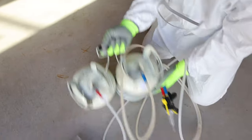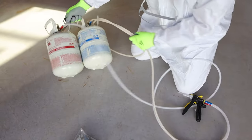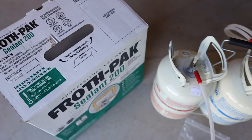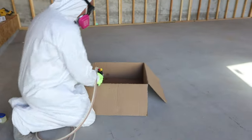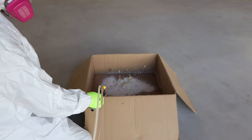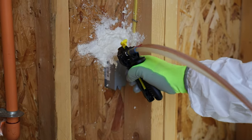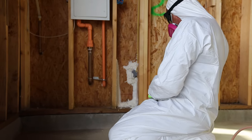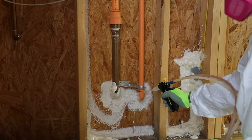This is not meant to be used as insulation — it's strictly for sealant. You want to mix it using the little handle between the tanks, shaking it back and forth to make sure it's really well mixed. Each kit comes with Part A tank, Part B tank, nine feet of hose, an instant flow gun dispenser, and the hose assembly. It also includes cone spray and fan crossover nozzles — eight cone nozzles and four fan nozzles — plus petroleum jelly. This box here ensures the product is mixing well and properly. It's super easy, cures in about 30 seconds, and covers all penetrations to keep everything sealed airtight from bugs, pollen, and moisture.